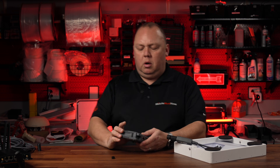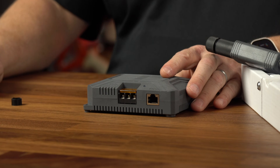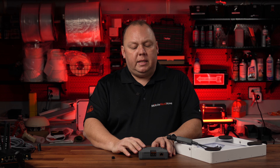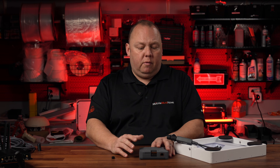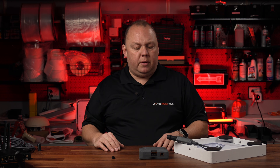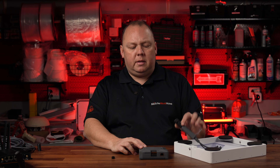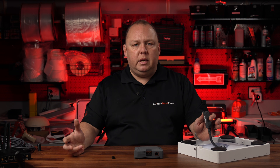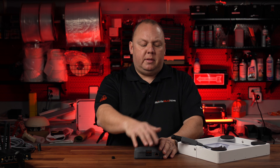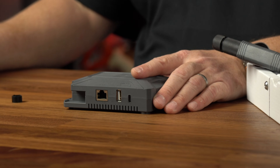Going over how the wiring would work and how this would be set up — you're going to run your 12 volt power straight to these terminal ports here, and they're all labeled and easy to find. This also has an optional ground to chassis for lightning protection built right into it. Now this is a DC step-up converter. So this will take your 12 volt house batteries or 24 volt — you can put any input all the way up to 36 volt into this — and it will step it up to the 48 volts that is going to run the Starlink. On the side labeled PoE, that's going to go out to your dish. You're going to use a standard Ethernet cable to connect up to this adapter here. And on the other side, once you've powered this up, you've got your LAN port that's going to go over to your WAN port on your router device.